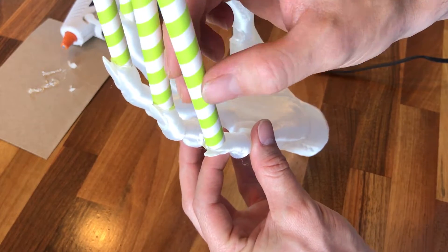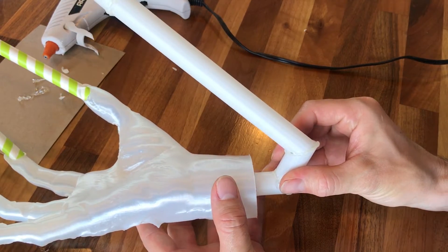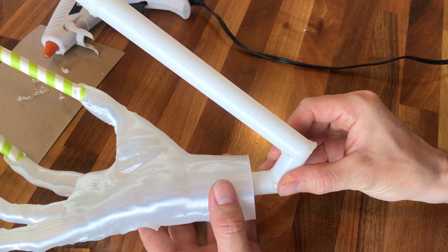Getting all the molten plastic to exit the mold is the trickiest part. It's important to have plenty of vents, as pouring molten metal into a cavity filled with plastic creates a fairly violent reaction, which you will see shortly.